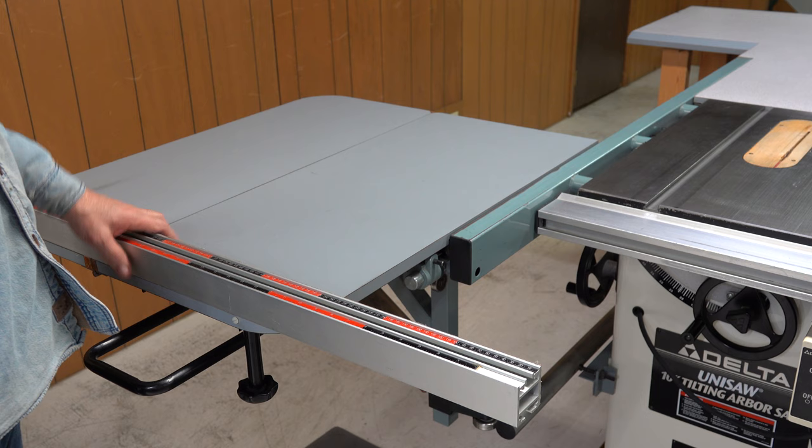Okay, number 33, do you see the wipe that the board is touching? Oh, it makes that go up and down. That piece is keeping debris from hitting you. So for you guys who are doing composite cuts and aluminum and other non-ferrous sheet stock, that will keep you from having any of those pieces hit you. So if you can make something like that, that has a wipe on it like that, it's so safe, it's absolutely mind-boggling. I can actually cut as much aluminum as I want now and I don't get hit by one piece.